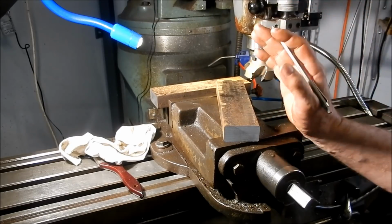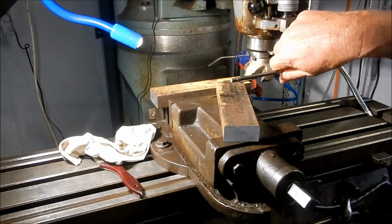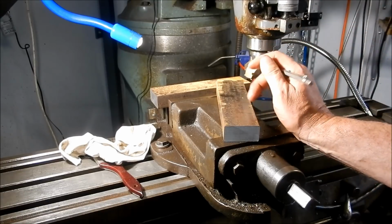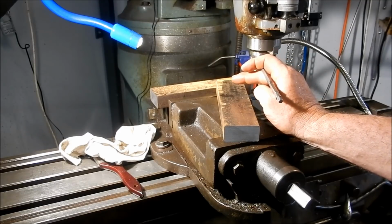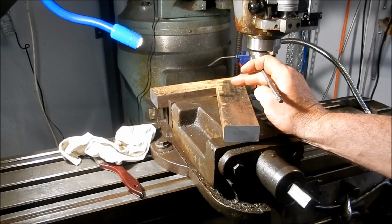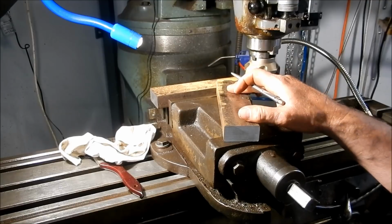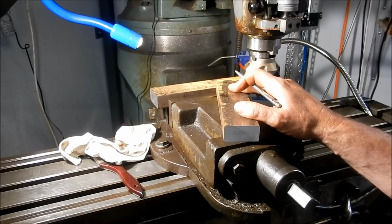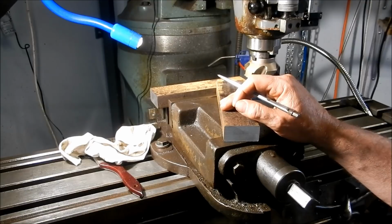And I've had long shafts that you fight the entire time, and I would tend to flip from headstock to tailstock, headstock to tailstock, to try and work the stresses around as best you can. And sometimes you get to a point where it just won't happen. You've got to straighten it up and send it out for stress relieving, and come back and try on it again. So just be aware that steel does tend to move if you are machining it, particularly on long slender lengths. Not so much of an issue with the short stumpy stuff we're doing here, but just something to watch out for as you are machining, and work with it.